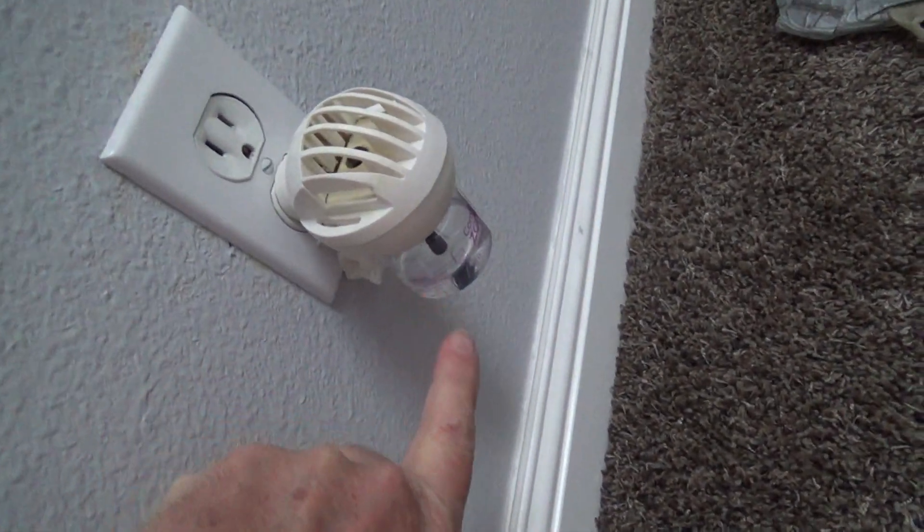I could do all that when I get ready to do the backsplash, because once I get ready to do the backsplash all the electrical is there — what I'm going to have to do is disconnect them. If I was going to save all these electrical outlets, I would pull them out, pull them all the way out of the wall, and tip them sideways or twist them sideways and push them back in the box — even with the wire still on there, with the breakers off. Then I can put the tiles on even with the electrical outlets still there.